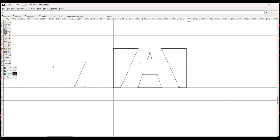how far away this point needs to be from this point if this line, which is supposed to be touching this line, was perpendicular to this and 0.8 millimeters. So in order to do that, I've got another right triangle inside of it, and it looks like this, right? So this has to be parallel to this, and where this starts is defined by this, right? So I know that this is 0.8 millimeters, and that it's one leg of the right triangle, and what I'm looking for is the hypotenuse, and I know the angle of this, right?